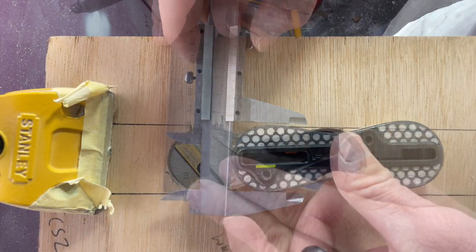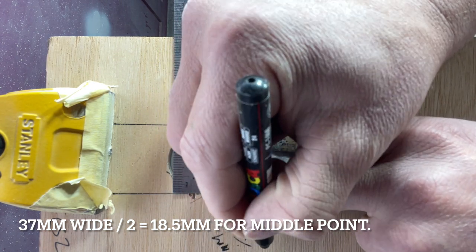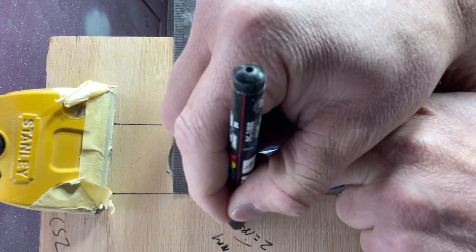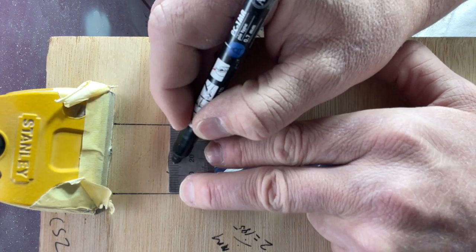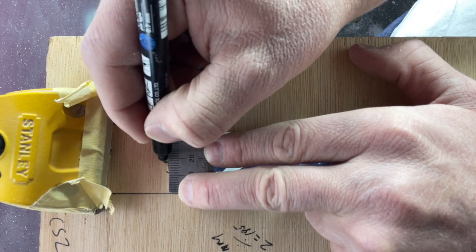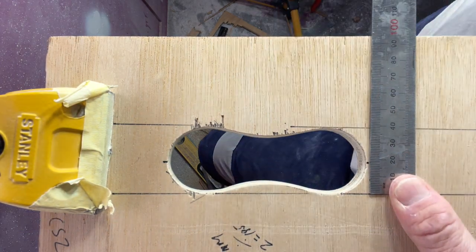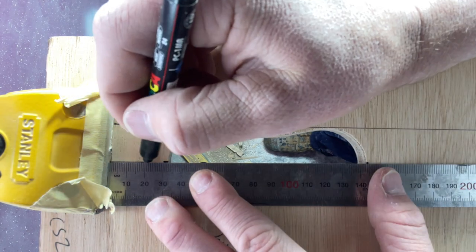Just do a little test run and make sure she fits snug - you don't want to make it too loose. Just don't forget you'll be routing out foam, so just make it nice and snug. Now we are getting into the nitty-gritty of this build: that box is 37mm wide at the widest point. Divide that by two for 18.5mm for our middle point. Run two straight lines down the outside, measure in 18.5mm and find your middle. That dot there represents the very middle of our box.